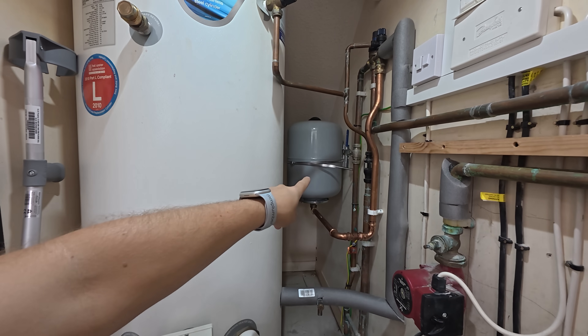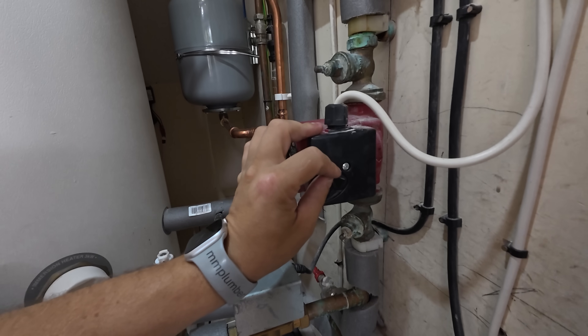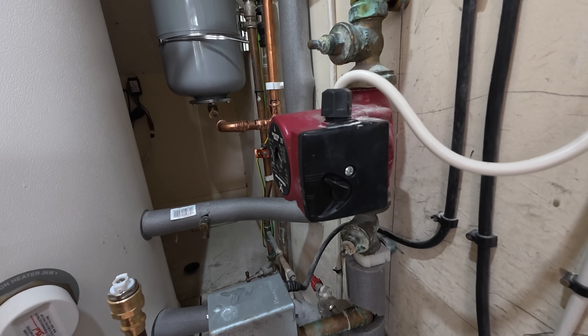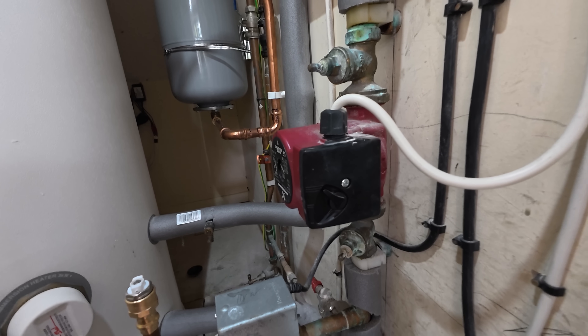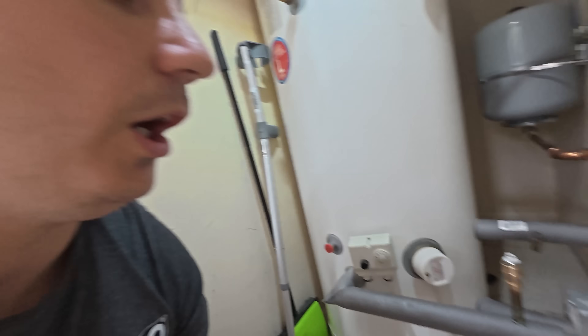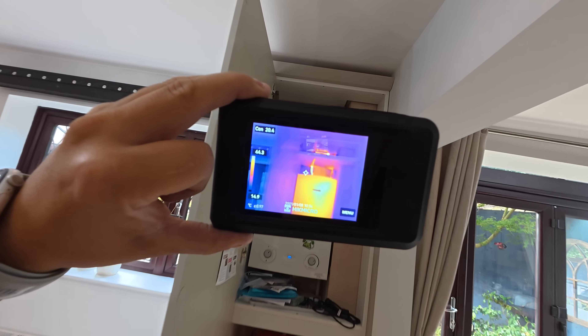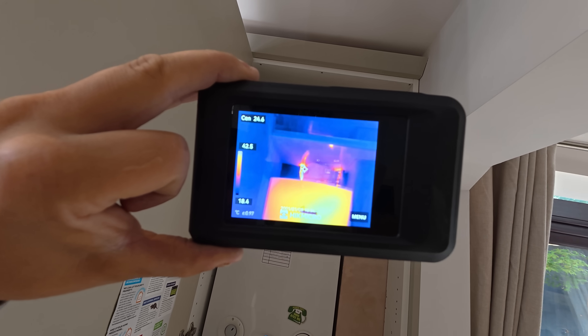Welcome back to the channel. On today's video we've got a house with no heating and no hot water. This is the same one where we fitted that new expansion vessel and we're testing the heating pump which controls everything — it doesn't sound very good. It's quite noisy. The system is completely full of water but using the thermal imaging camera we can see the pump is getting warm from where it's just been working and not doing anything. When we test and trace the pipework, the boiler flow is warm but we don't get any circulation back down to the pump.